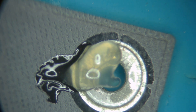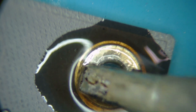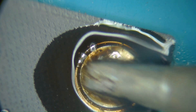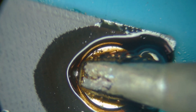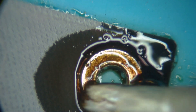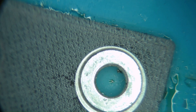Let's do a little bit of flux. Now this one we just want to heat back down. We'll get some fresh solder there, some fresh solder here for good heat transfer, and just lay the whole tip down on that. This isn't a corner where we can hot-air this. Oh there you go — it moved, the whole thing moved. That means the whole thing is definitely melted. That is going to be better than factory. There's not going to be any air voids in that now.